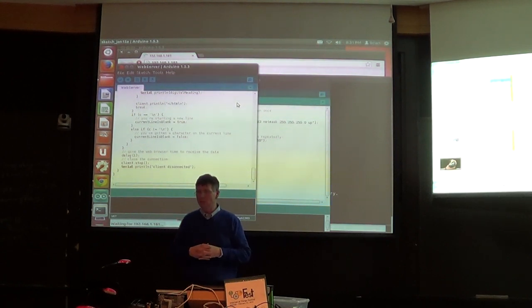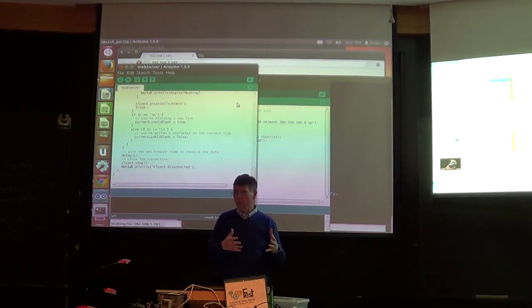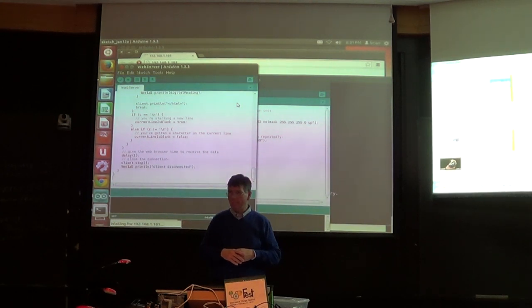the flip side of it is, this isn't the way I do it, right? So this is the only way you could do it with Arduino, but the way I do it. I'm wondering if there's an easier way to run the web server on the Linux side. Absolutely. And then have some other CGI script pull the sensors and grab the data that way. That way you could, in theory, serve multiple requests at the same time. Right. Multiple different clients requesting the same page, right? Right. You could run like HTTPD or Nginx or some, not full-blown Apache, but something less. Yep.